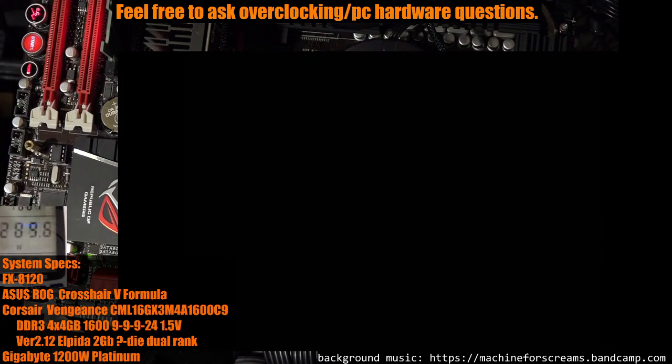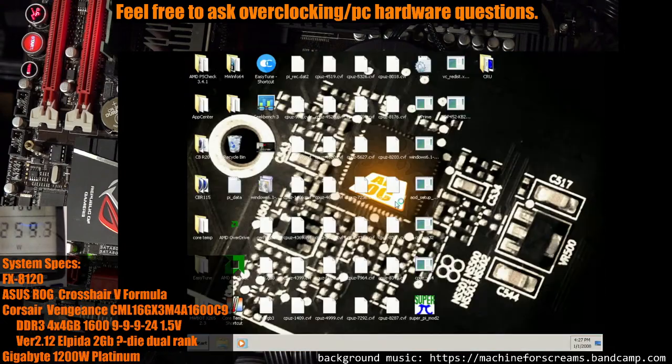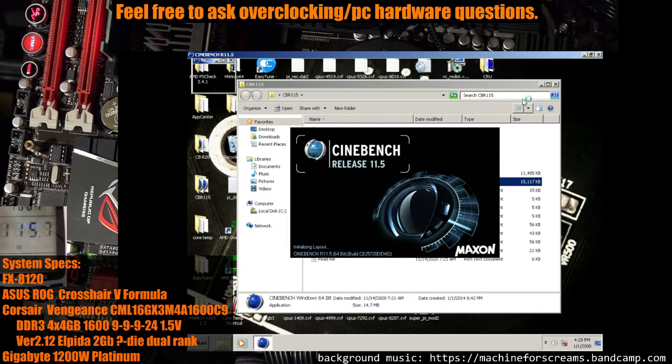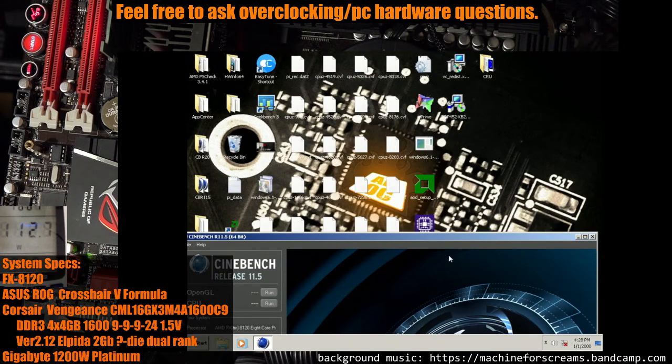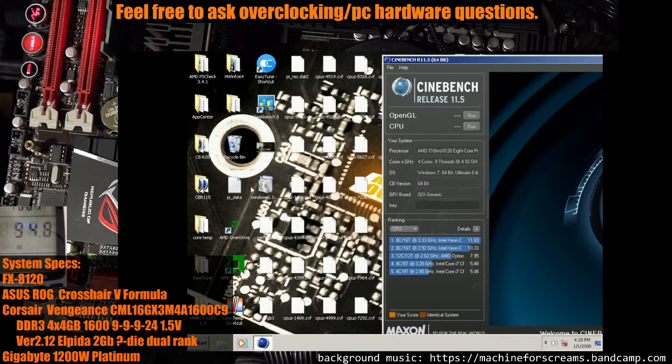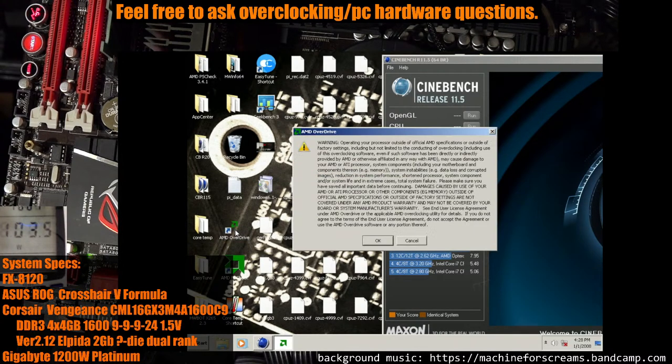Well, I've already set the CPU Northbridge voltage to 1.3. Now, I have a better idea for figuring out what that voltage is. Later, I might underclock the CPU to a gigahertz at low voltage, put a really small heatsink on it, and poke around the board until I find which voltage regulator is outputting the voltage listed in the BIOS. I almost feel like that might be a voltage regulator that doesn't necessarily even exist on other motherboards.